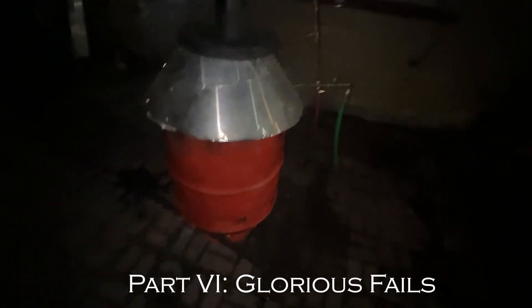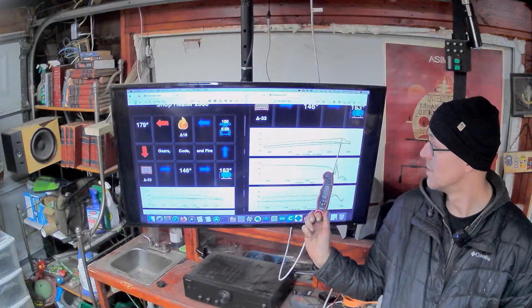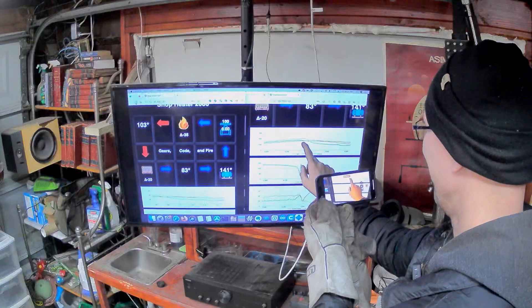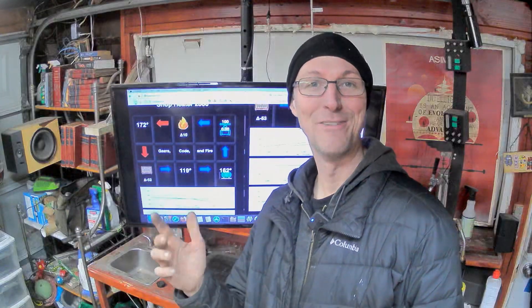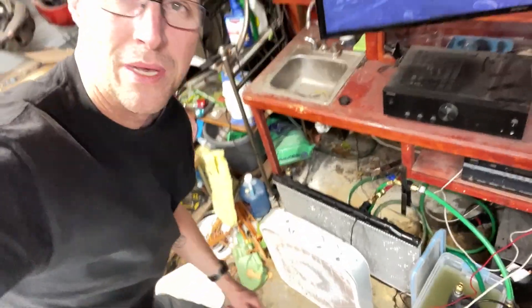I went all in on heater efficiency improvements while paying no attention to the radiator or any of the tubing. Dangerously hot, but there's a pressure release. Did something just break? Here's the temperature going up, up, up, up - and I got a little worried. The flow just stopped. You've invested nothing in cooling efficiency or flow dynamics, so... Uh oh. Oh no. Catastrophic failure. Because the temperature of the cistern at that point was about over 150 degrees. That's how efficient it is. I started losing sleep over it. My pump overheated. My solder melted.